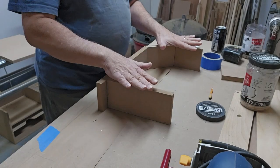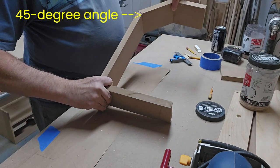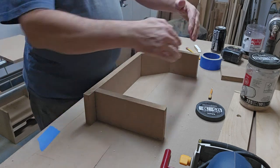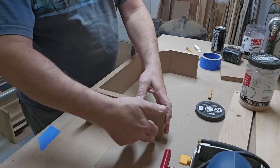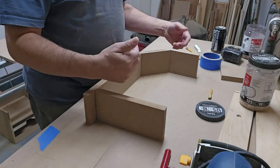So I have the rough shape of this thing. I don't know whether you can see it. I think I can do this. It'll be basically something like that. A rectangular cabinet with a mitered corner. These two sides will go against the wall. I've set this piece inward so that the molding can live back here. And I'll cut this off to length so that it also clears the molding.